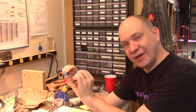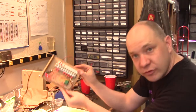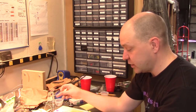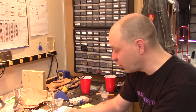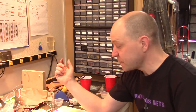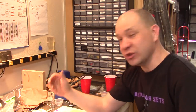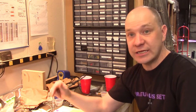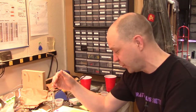Right here I have a couple of little 5-volt coil relays with my 12-volt power supply. When I connect my relays in series, I'm not sure if you can hear that, but they are both firing. So relays do work in series, but you need enough voltage to run both of them, or enough voltage to run them and whatever else is in series. So my solution is either get 24 volts, which I don't want to do, or use a smaller relay with a smaller LED such that together, with resistors, they equal 12 volts. I'm going to put together a prototype of that.